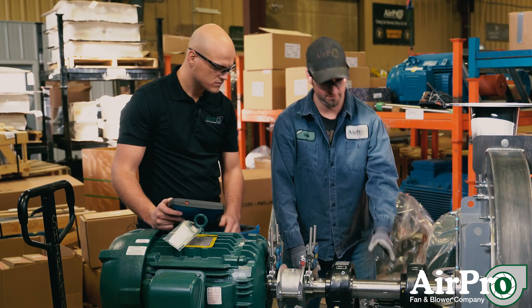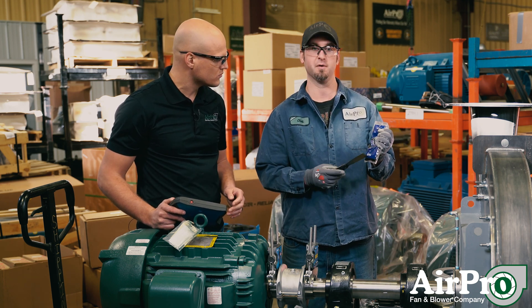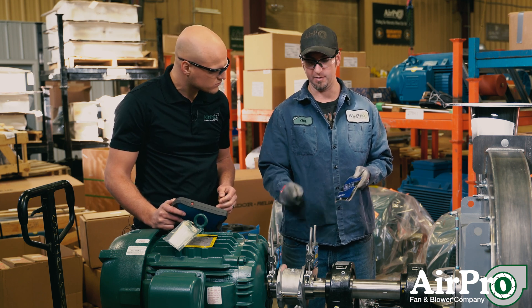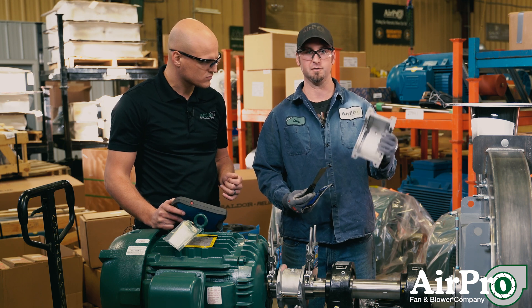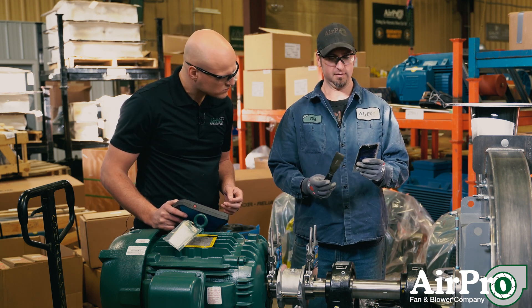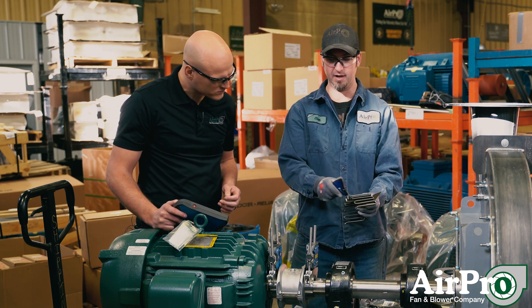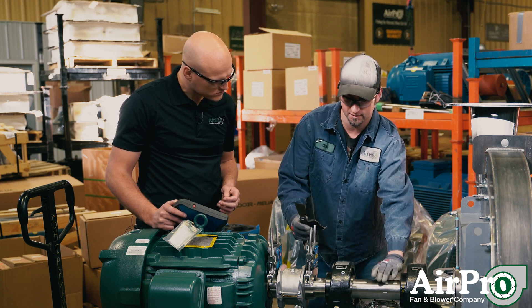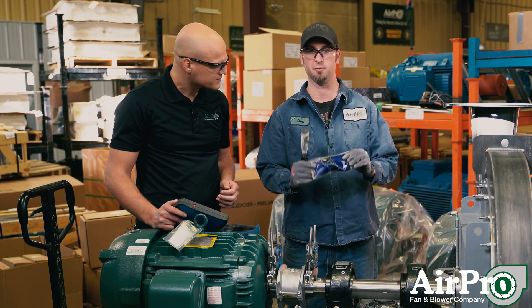For each coupling they specify a certain number of grease packets — this one takes four. We will have four packets that we need to fit inside the coupling housing. We do that by physically cutting the corner of each packet open and squirting the grease into the grid and on the coupling. While rotating the shaft, we manually work it in until we get all of the long-term grease in there.